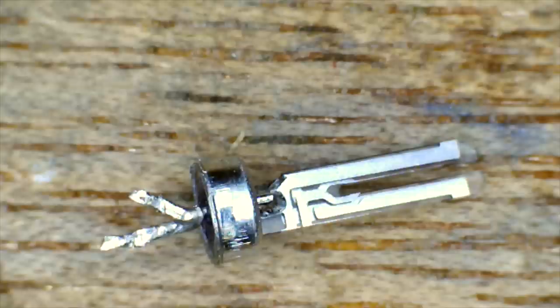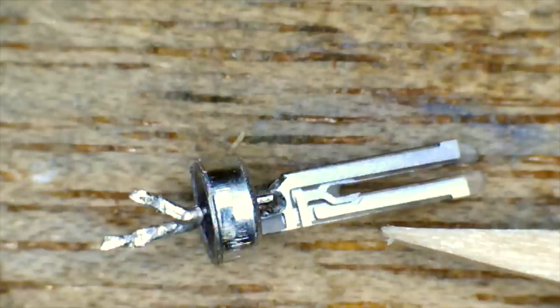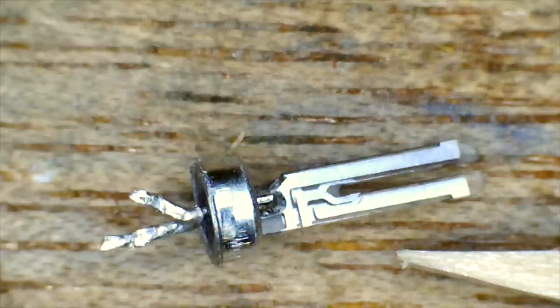Here is my tiny little quartz crystal. At one end we've got two wires, and the other end — which I'm pointing at now — is a tiny sliver of quartz crystal. It's about a millimetre across and three millimetres long. The idea is you push electricity into the two wires, into the quartz crystal, which causes it to change its shape ever so slightly. And then when you turn off the electricity, the quartz crystal relaxes and it emits a pulse of electricity of its own.